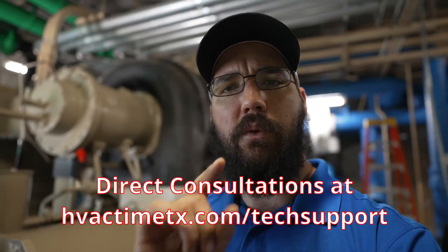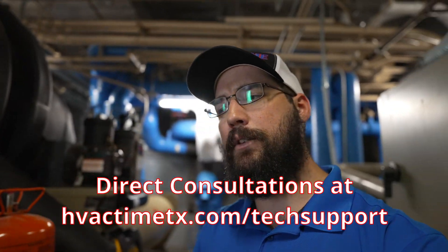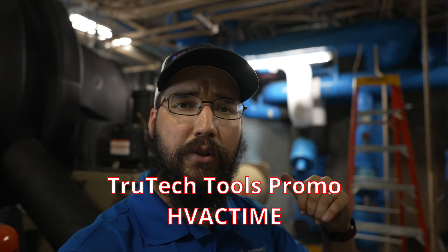We had a lot of atmosphere in the system and I was struggling because I wasn't seeing that reflected in what my purge was doing. If I actually had that much atmosphere where I couldn't run my minimum current set point of around 40 percent, I should have been seeing a high reading. I was running 70 degrees on my suction, and I verified that my actual suction line temperature probe is reading accurately — it's within a couple of degrees, good enough for now — but something else stood out to me.